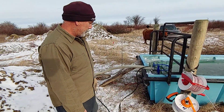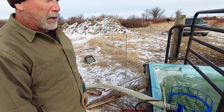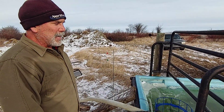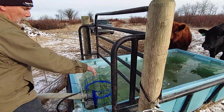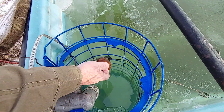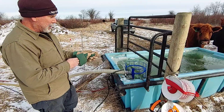Some of the issues that we noticed: we did bring the wrong trough. We do have an old tire trough — we should have brought it over instead. This one does freeze. We've had colder nights than forecast, getting down to minus 13 sometimes. So in the morning I have to come over, chop it to free it, and then thaw around where the float is, using some hot water, so I know it's not going to get a chunk of ice blocking it and cause other problems.